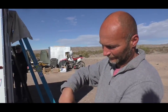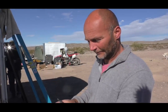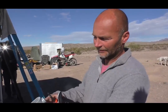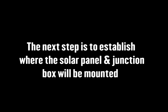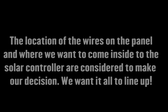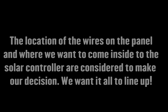The way I fixed mine is I used a self-tapping screw and went straight down through the middle. You can also use a bolt — drill out the hole, find a nice solid spot, and bolt it down. And like I said, caulk all the way around the edges so no water can get under it. Butyl tape under it works too, and we have that on hand.